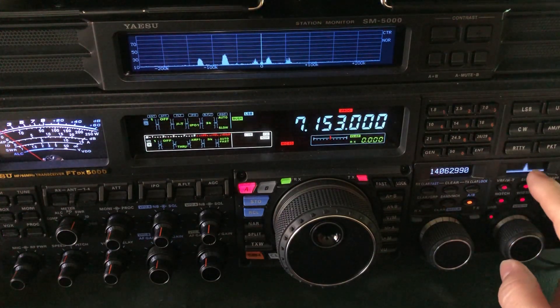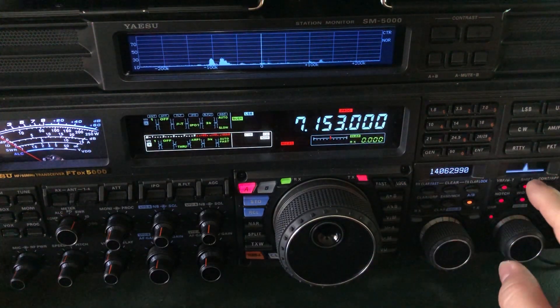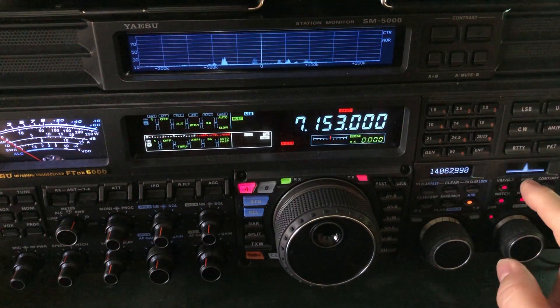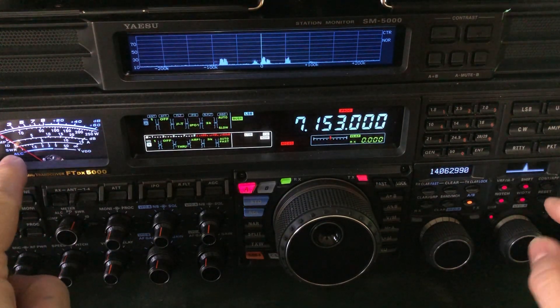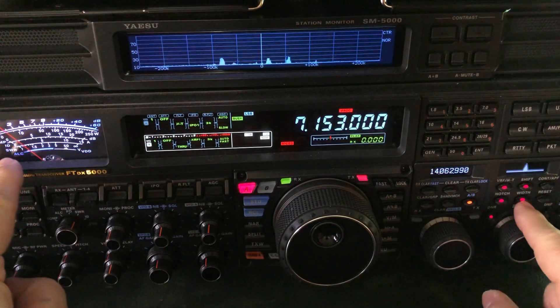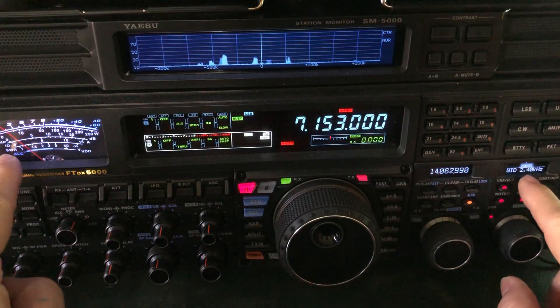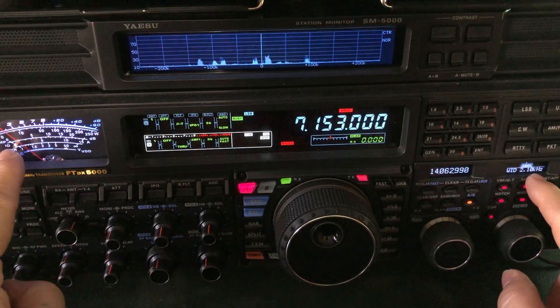What I've done here is shift the center point of the Mu Tuner away from the frequency — they're two kilohertz above. So I'm shifting away from where they are with the Mu Tuner, dropping them down in signal strength on the S-meter. Notice how thin he sounds — that's because I've got the width set at 1.5. Since he's two kilohertz away, I want to get my receiver below two kilohertz of bandwidth.